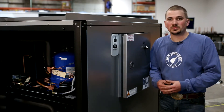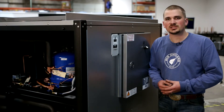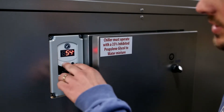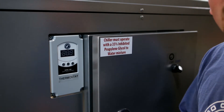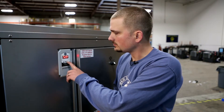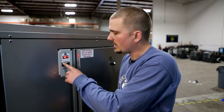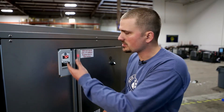Now that your valves are open, turn the door switch to the run position and adjust the thermostat. With those valves open, the compressor will come on assuming the thermostat is calling for cooling. Thermostats come factory set at 55 degrees with a differential of 3 and 4 respectively per stage. A single stage unit comes set at 55 degrees with a differential of 3. To adjust: press the set button, it brings up 55 degrees — the set point for stage 1. Run it down to your desired temp. For example, to run glycol at 40 degrees, hold the down arrow until you reach 40. Hit the set button and it calls the compressor on for cooling and takes you to set point 2 for stage 2. Press set again to return to the home screen displaying your current glycol temperature.